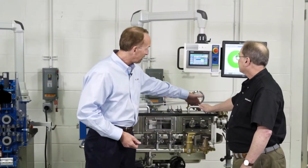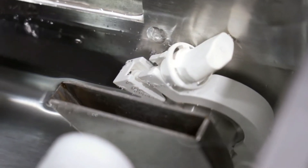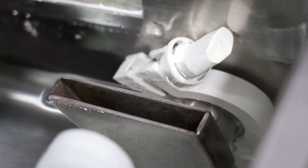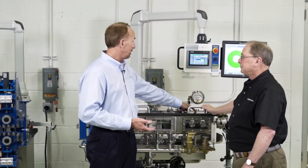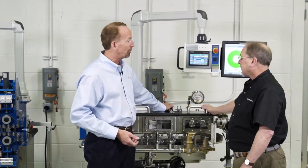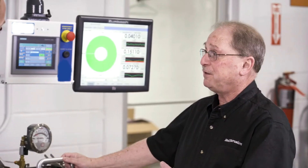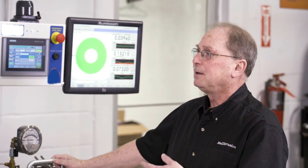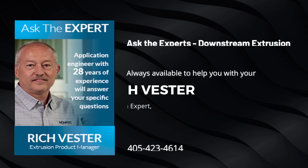And while we're in there, even the water level adjustment — we've used a similar type of triclover fitting to adjust your water level for very precise, especially again, free extrusion. The water level in relationship to the tube is very critical, and this is one of the features that actually makes this unit work extremely well, just as well as an open tank as it does a vacuum tank.